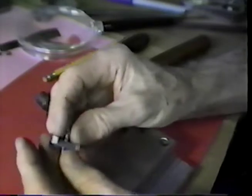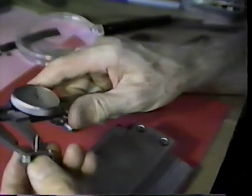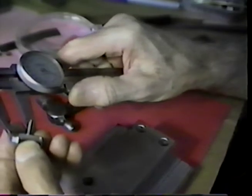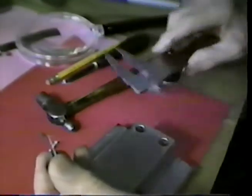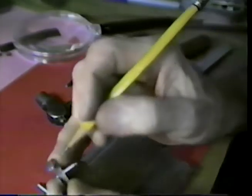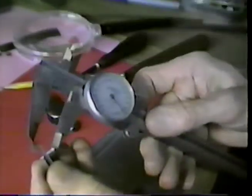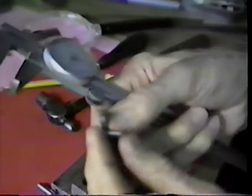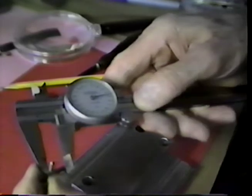Now let's make a measurement here. This is not an absolute measurement, but it can be measured with a caliper or a divider. I'm going to hook on to the side of this arbor and measure to the landing position about here, and then I'm going to compare to the other side, and we'll adjust for about a landing position, go to the other side and see if that approximately reaches the tip, and it does not.